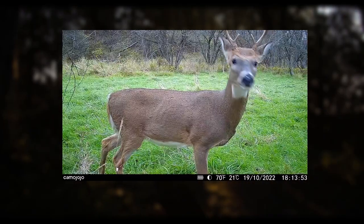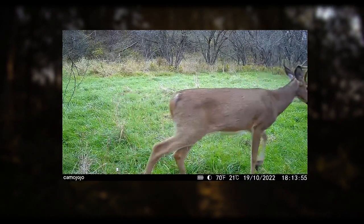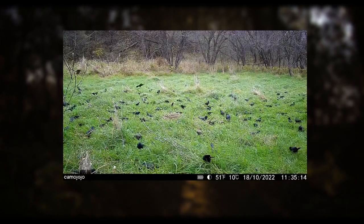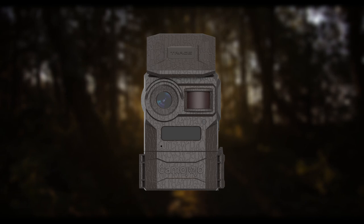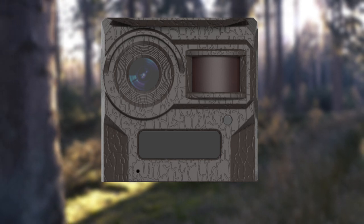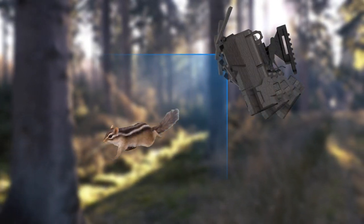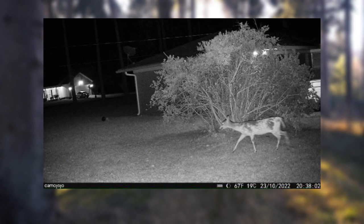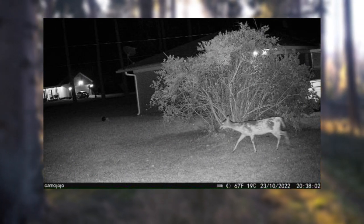The passive infrared technology can function both during the day and at night when there is no external light present. To record during the day, the trail camera, like a smartphone's camera, analyzes the ambient light and begins recording at the appropriate exposure time. Here is an explanation of the nighttime operation of the cameras. Rather than relying on the PIR sensor during the night, the camera switches to the infrared LED mode. Any animal that moves in front of the lens is now meticulously documented using only the infrared filter. Black and white images instead of color ones are produced because of the limitations of the technology.